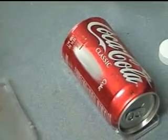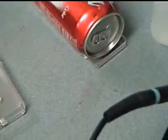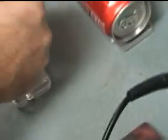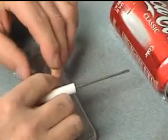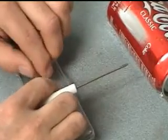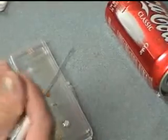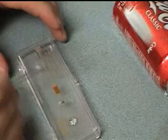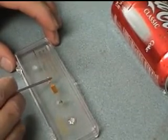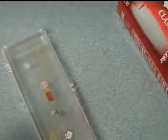The next step is to position the gauges on a clean surface, and the boxes — the strain gauge boxes — are an excellent choice. Don't handle the strain gauge because your body oils can get on the gauge and hinder the adhesion.